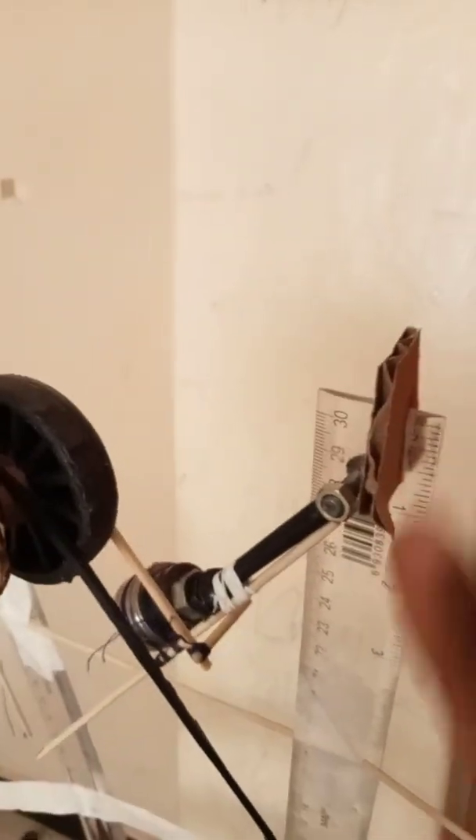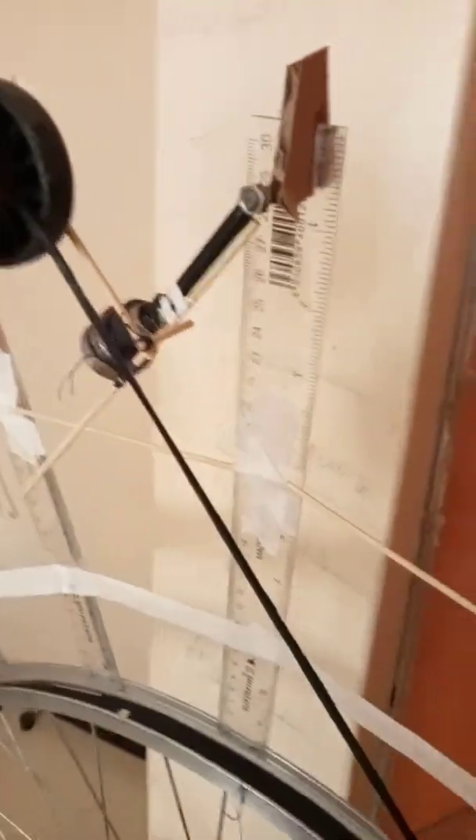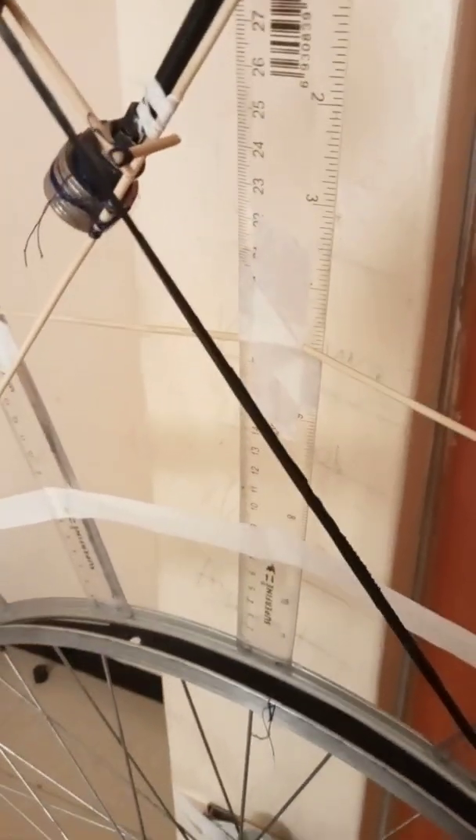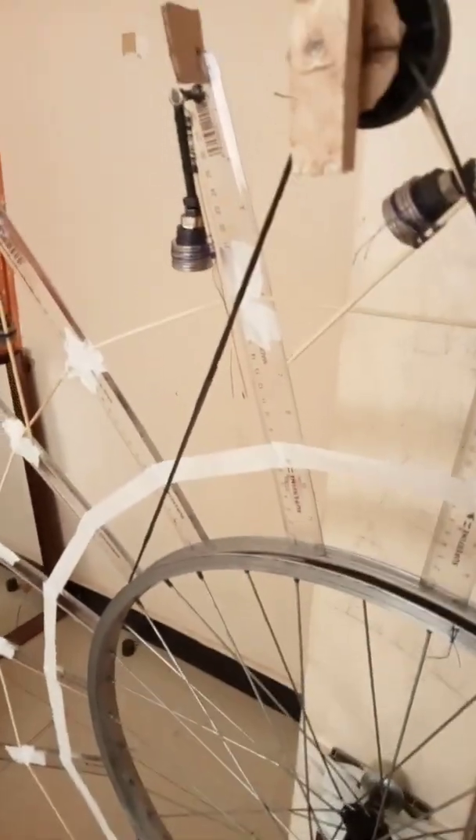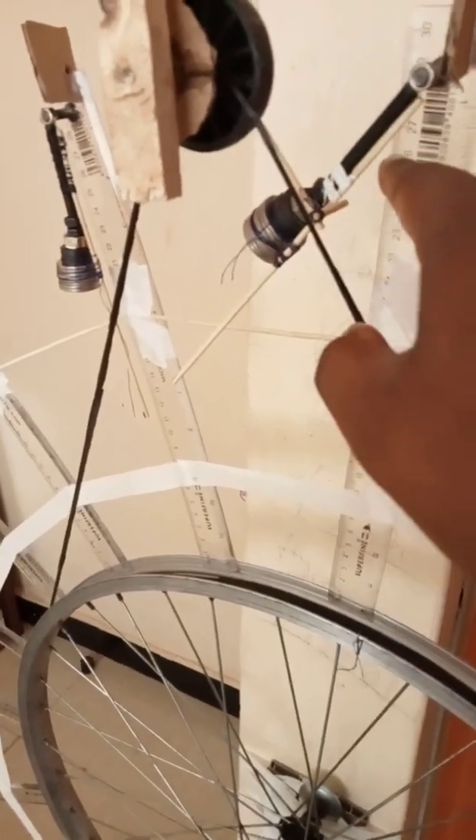As you can see, you have the extended lever arms all around the right-hand side and the dropping lever arms at the left-hand side. But when you look at the weight at the top, it is not straight — it has already been lifted a little bit by the resultant moment. What I've been able to see is that the resultant moment is able to rotate the system and also drive the upper pulley if lifting the weight is not included. But when you include the weight, it is not able to lift it completely.